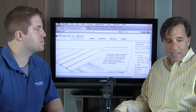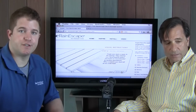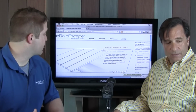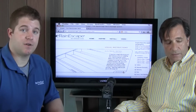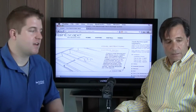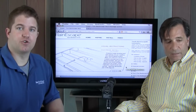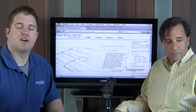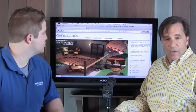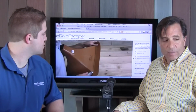Okay, putting the decking down. Yes, and actually before you put your decking on, we have 2 sealants. We have a caulking and we have a tape. What you're going to do is tape the joist down, and that tape is a butyl tape, so it is a self-sealant. That actually helps you out when you drill your deck boards down, because it is a self-sealant so that there is no water that can penetrate through. We have some better photographs on how we're going to put this in.